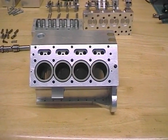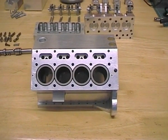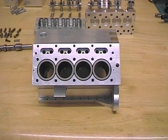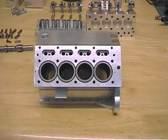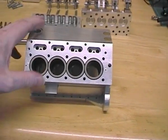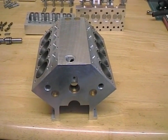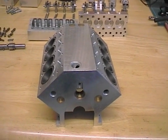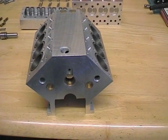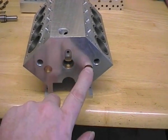I don't have a bulk of water in there because I think it's more efficient just to shift the water quickly and let the radiator cool it down — that's my idea and I hope it works out. Otherwise it'll be just a short-running engine, unless I machine bigger gaps in the cylinder block to allow for more water. The top hole there is where the thermostat housing is going to be — whether I put a thermostat in there is another thing, and I probably won't. These bigger holes here are where water's going to go in on both sides. The bottom plugs there are a mistake.